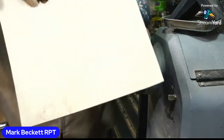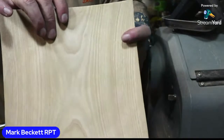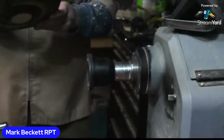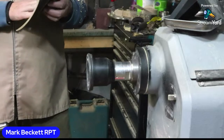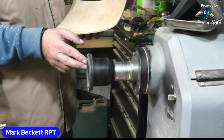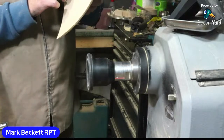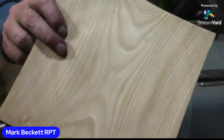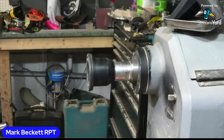Right. It has left just a little mark. You can see it. Now, Paul has put in, those holdfast chucks have an internal and external O-ring with a hard plastic ridge between them. Too much vacuum and the O-ring overcompresses and the plastic ridge leaves a dent in the wood. And he's also said, don't ask me how I know this. Thanks, Paul. That'll sand out with hand sanding with the grain. Yeah, it won't take much.